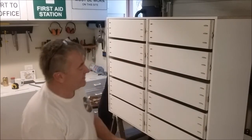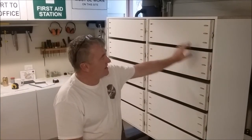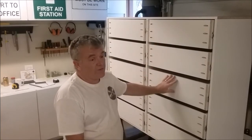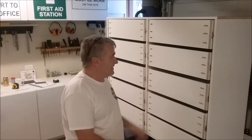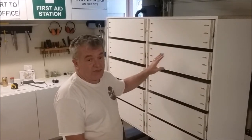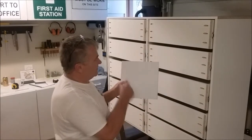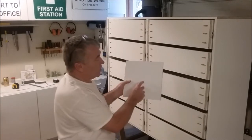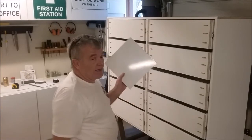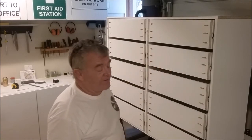Next thing is to cut all the fronts for the run of the drawers. Now this carcass and the drawers are all made out of the matte finish melamine. Not ideal for the front of cabinets or cabinet tops, even though it's pretty hard to see. It does have a stippled finish on it, and constantly touching with your hands does discolour it over time. So the top and the front of this will be out of the high gloss melamine finish. Touch this all day long, it won't discolour it. A lot more hard wearing than the matte finish.